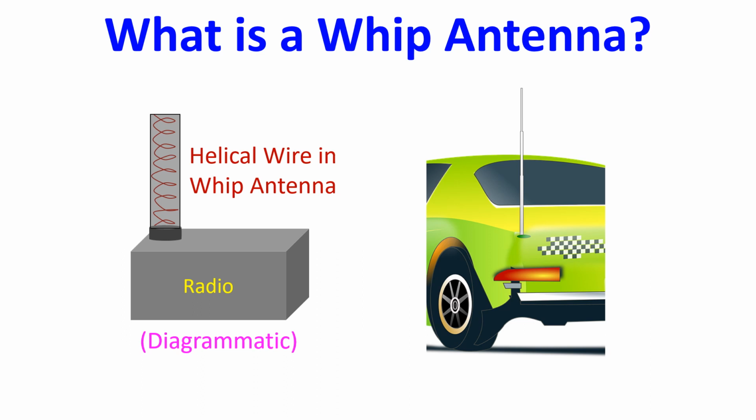A whip antenna is a common sight on four-wheelers these days, as most of them have a built-in radio, often covering FM and AM broadcast stations. A whip antenna is named so because it is flexible and hence has the movement like a whip when flexed. In some antennas, the active element is inside, while in yet others you can see a wire spiraling over a fiberglass rod. The popular rubber ducky antenna of handheld VHF and UHF amateur radio are whip antennas.